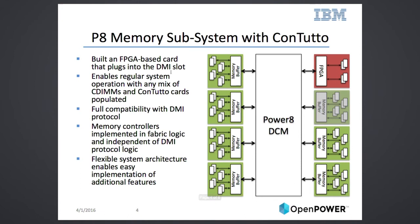In this project, we said: if we can replicate the functionality of the ASIC in an FPGA and put that right on the memory bus, then because of the flexibility of the FPGA, you can populate the server with the custom DIMMs and the FPGA-based card at the same time, and you can build basically any memory controller you like — not only targeting DRAM but anything else. We try to keep the architecture of the FPGA as flexible as possible so that is actually easy to do.